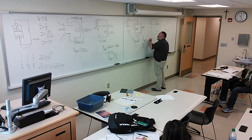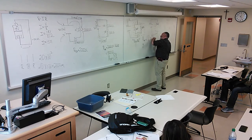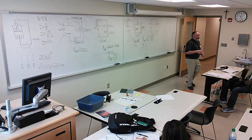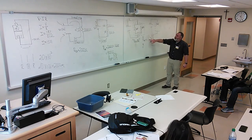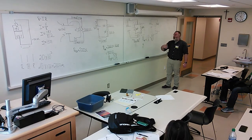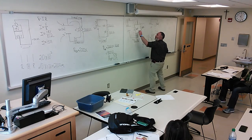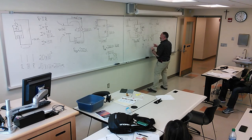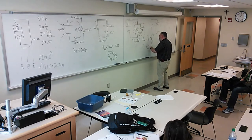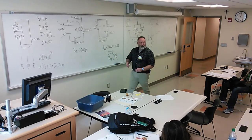It's actually pretty simple. What we do is we take 1 over the first resistor, and we take 1 over the second resistor, and then when we're done, we take 1 over the result. Okay? They add in inverse. So we numerically calculate 1 over the resistance of the first one plus 1 over the resistance of the second one. Unfortunately, when we're done, we get units of 1 over ohms, so we have to bring the whole thing back up by taking the inverse. So let's do that. 1 over, I'm going to call this R1. I'm sorry, I just put a 2 there because I said R1, but it's the same. R1, and this guy is R2. R1 is 2,000 plus R2 is 1,000. And then when we're done, we have to do that. Did I do that right? Did I make a mistake?